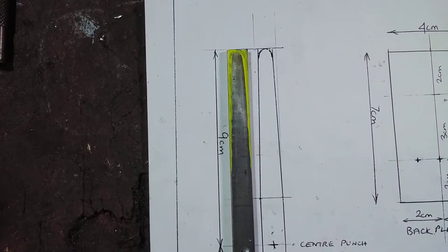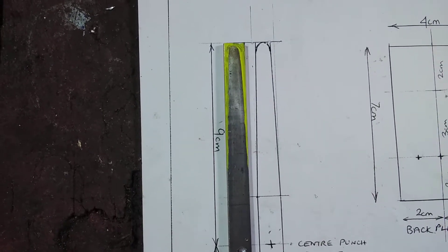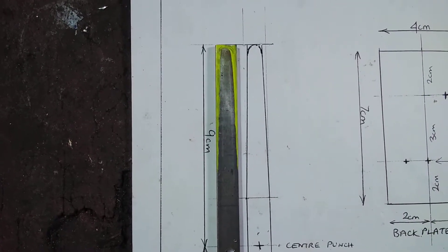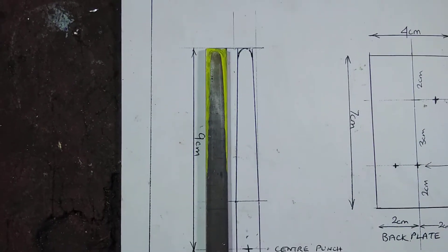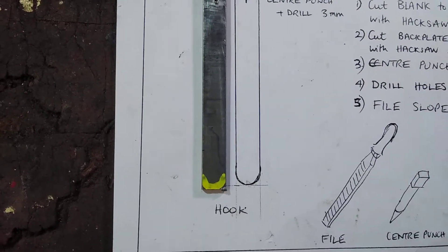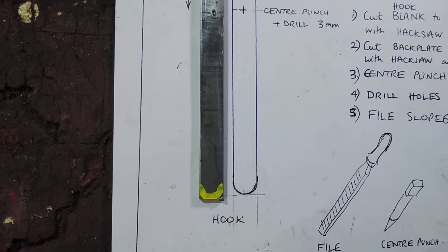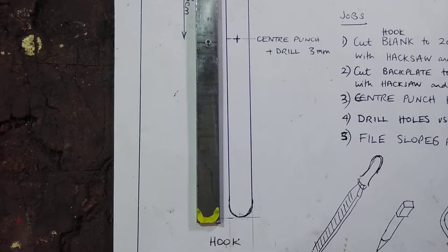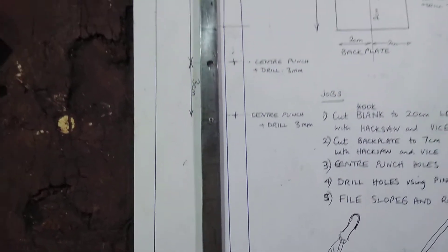To help you see in the video, I've marked the areas I want to cut off in yellow. You can see I've marked the taper and the curved edge on the end here, and I've marked the curved edge on the other end. The yellow areas need removing with the file and then smoothing down so that there are no sharp edges, otherwise these would cut your coats.